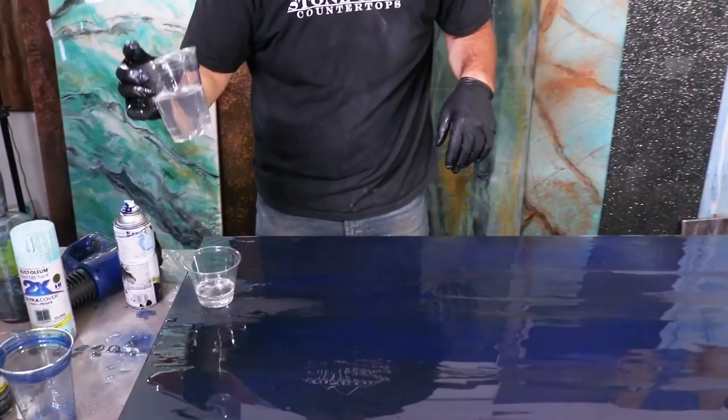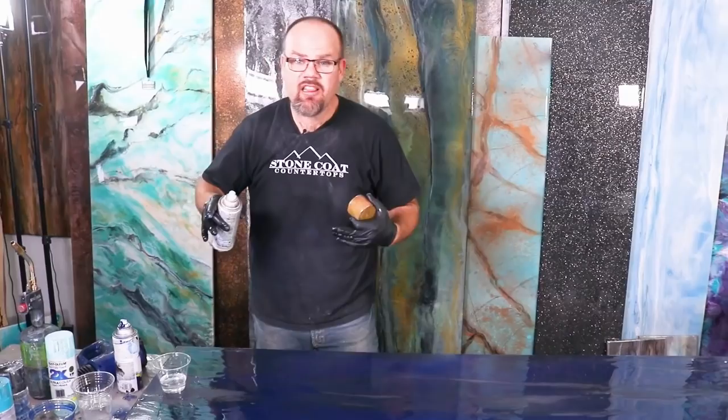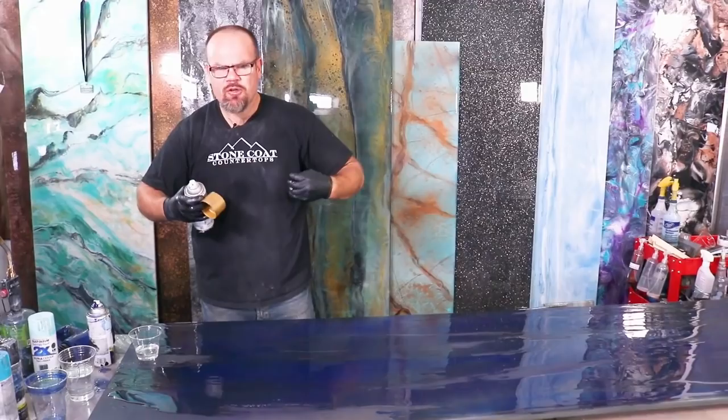Okay guys, good pro tip here. We're mixing up 3 ounces per square foot of our project. We're applying a lot of this randomly. Normally, we'll use our 1/8 by 1/8 square notch trowel, but because we're adding so many undertones, it's slightly different. So be sure that you mix your material very well so you don't have sticky spots, and budget for about 3 ounces per square foot.